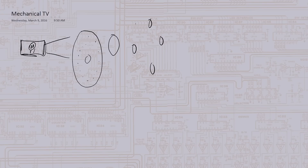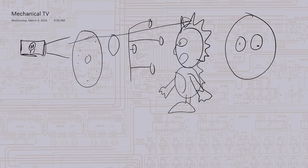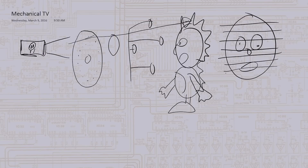How about mechanical television? Wait, how can a television be mechanical? It can be. Let me explain. You would have a light here that shines through a spinning disc with holes in it called a Nipkow disc. This would go through a lens, with four sensors in an array and then a subject — that's who you're filming. The spinning disc causes flying spots to scan across the person line by line, very much like pixels today or a CRT electron beam. The amount of light bounced back by the spot gets picked up by the sensors, and that's your pixel value. That's how the camera works.